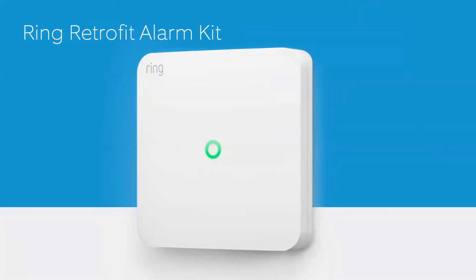If you already have a wired alarm system and want to use hardwired contact closures, you can make it smart with the Ring Retrofit Alarm Kit. It's a wire-to-wireless bridge that connects your existing hardwired contact sensors to your Ring Alarm via Z-Wave. It's an eight-zone connector, and if you have more than eight zones, you simply add another Retrofit Alarm Kit. This is a passive device, so active glass break sensors or active motion detectors still need to be externally powered, but the contact closure runs into the Retrofit Kit, which then transmits wirelessly back to the base station.